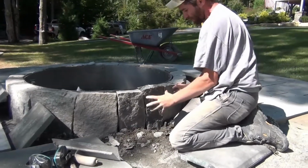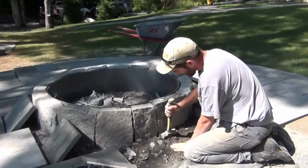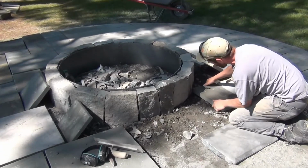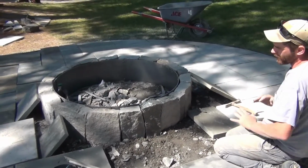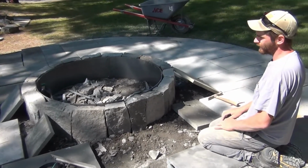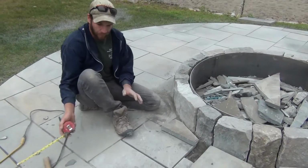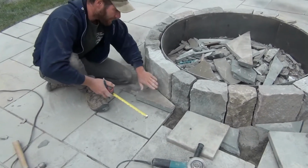And they've got the pressure of their neighbors if they're nice and tight. Then we're compacting in, and then when the stones are set, we're going to keep them right tight against here. Then we're going to seal it, gator dust it, and that'll be a bound system ready for Adirondack chairs and marshmallows.